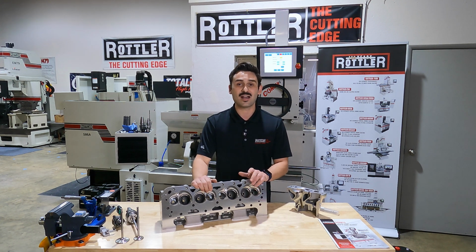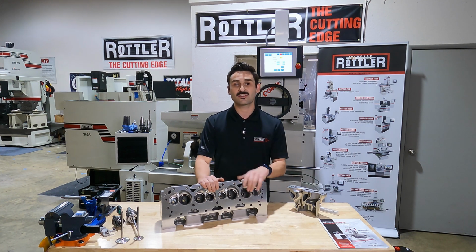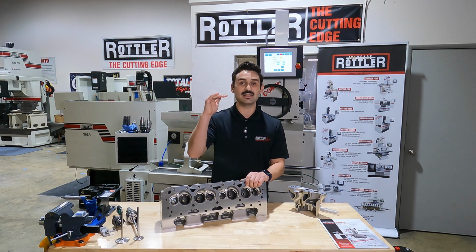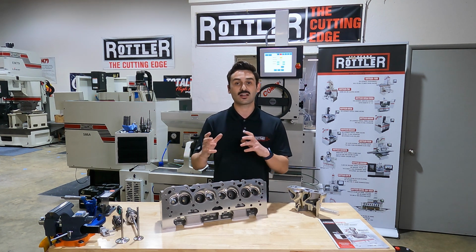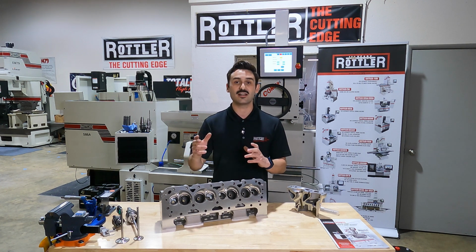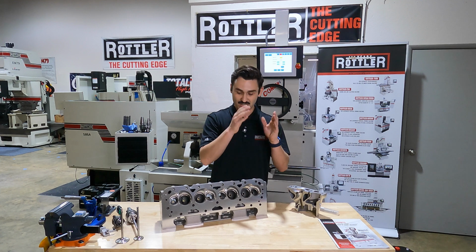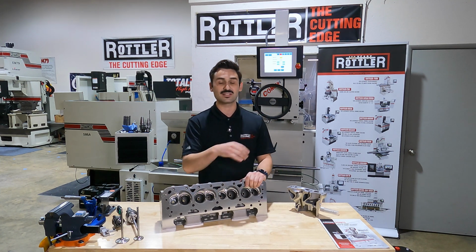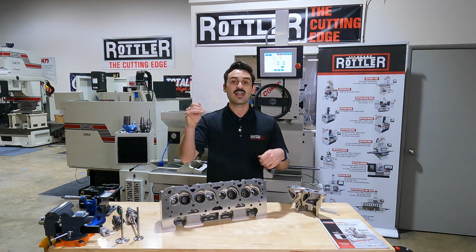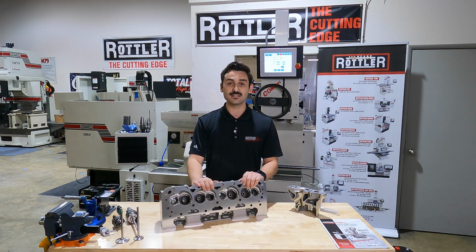It's a semi-automated machine. It features our Manualmatic software, which allows you to preset the depths or the heights for the pilot to lock, unlock, and the spindle to turn on and off. Once those things are set, as the operator, we can simply go down the line and the machine takes care of itself. All we do is keep our hands on that steering wheel and watch the machine as we see our DRO get to the correct positions.